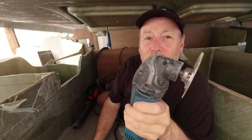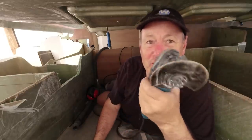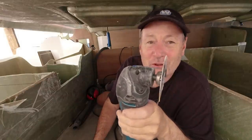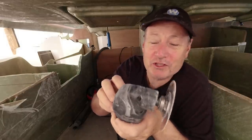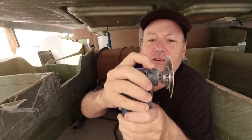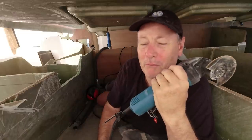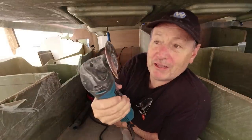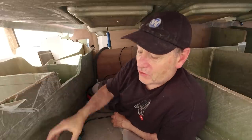I think I'm going to have to modify the tool. Do I void the warranty? Probably. But the reality is it's not fit for my purpose, and wasting two hours in here at my wage rate isn't worth it. So I'm going to take it down to the factory, spend a bit of time on it, get it nice and flat on the belt sander. It looks like rubber or some compound plastic. If I can sand that flat, I reckon I'll cut my time in here by 60–70%. Sometimes modifying tools is better than racing out and buying a new one. I can't buy these blades elsewhere — they're the only ones that cut through fibreglass and maintain an edge. I've tried wood and metal blades; you're blunting them within half a second. This particular blade I've had for about six months and it's still going strong.